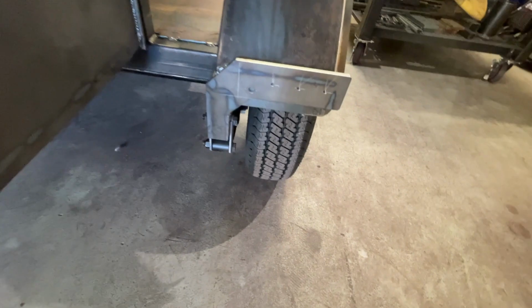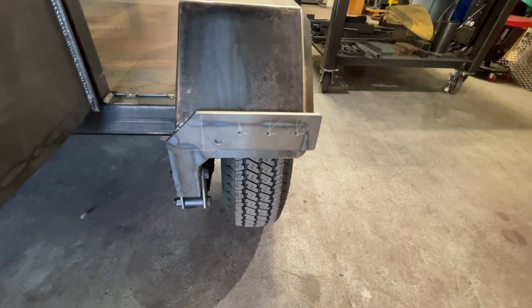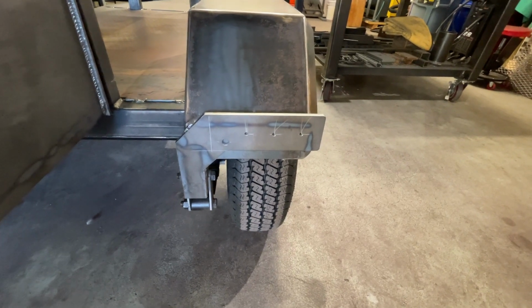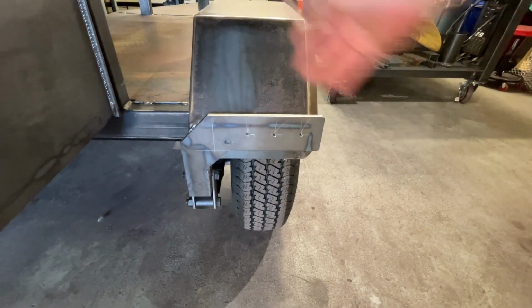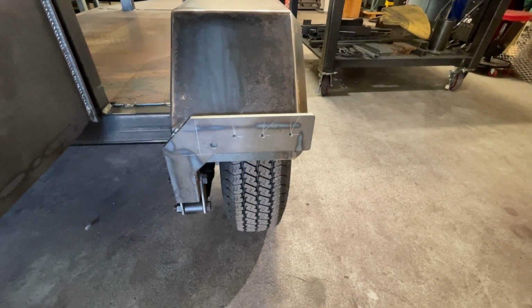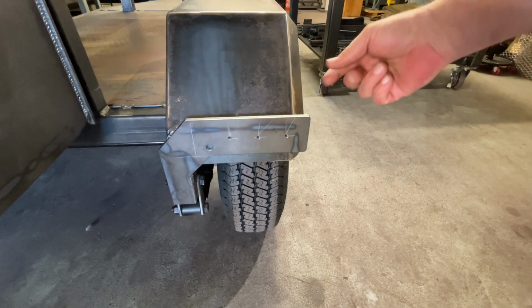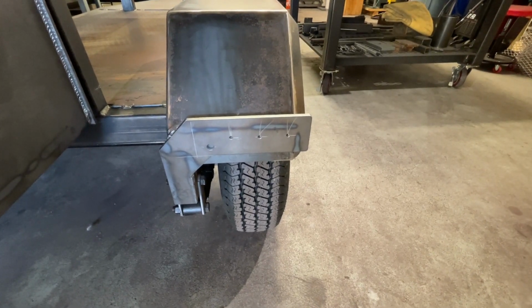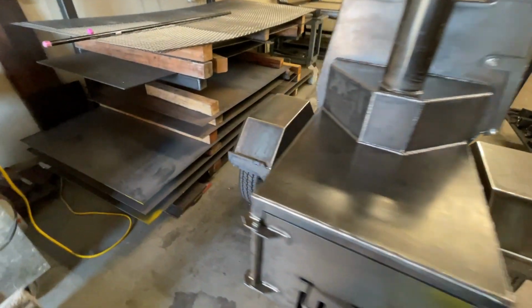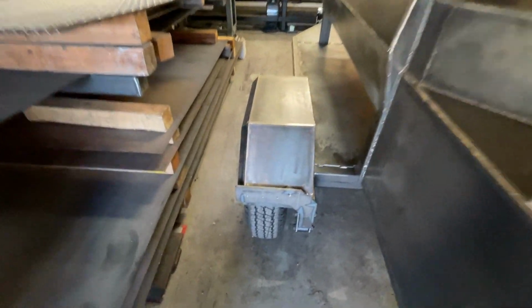And see, I've got it welded in to the light bracket there. All my problems with worrying about how I was going to get the wires in are done. Now I just drill through the fender, tuck the wires inside the fender, and secure them so they're hidden. My mounting holes are at the right height where I can just put the bolts in through the back, through the fender and into the bracket. So it worked out good. Got both of them on.